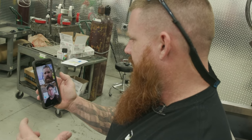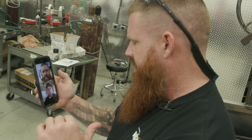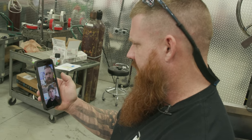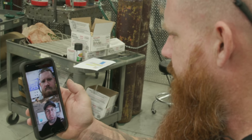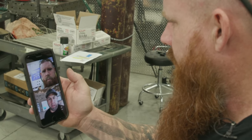No, I think if we just go equal distance, half above, half below, just split it in two, and then maybe mill out some quarter-20 studs that are 2.5 inches long, and then we can cut off the rest. We can just through drill it and then mount it right up top, bolt it up. Yeah, we can just put a couple holes in the back of it and bolt it right to it. Perfect.